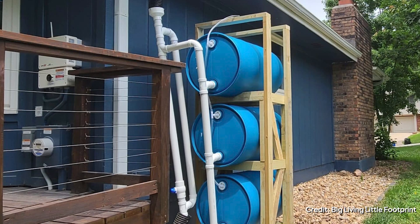One of the best ways to learn how to do these things is to see how not to do them. In this first picture, we've got a rainwater harvesting setup — and I see a lot of these online. There are three tanks kind of stacked on top of each other. I love rainwater harvesting, but the blue rainwater harvesting barrel is what I refer to as the gateway drug, because people don't realize how much volume their roof produces. These barrels are only 50 gallons, 200 liters, and a roof will produce thousands of liters in a decent rain event. You're really not going to collect very much — only 600 liters in these three tanks here.